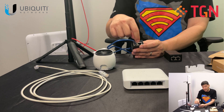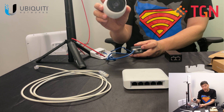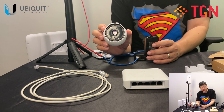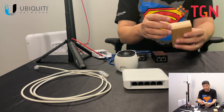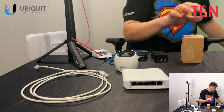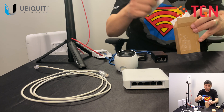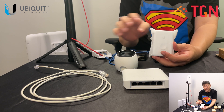After the injector output, this is where you connect to your LAN port or your data. Now in the case if you are actually deploying a camera, the camera will be powered similarly by a PoE injector. So the injector will have to be protected at the same time. In this case you will need an additional unit where we will also similarly protect the camera. So now this is the camera surge arrester — we have one surge arrester to protect the Nano Station and right now we have another surge arrester to protect the camera.